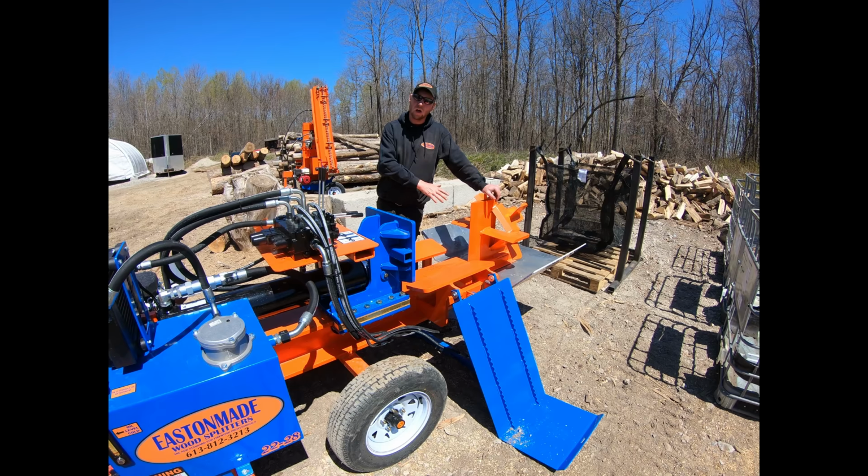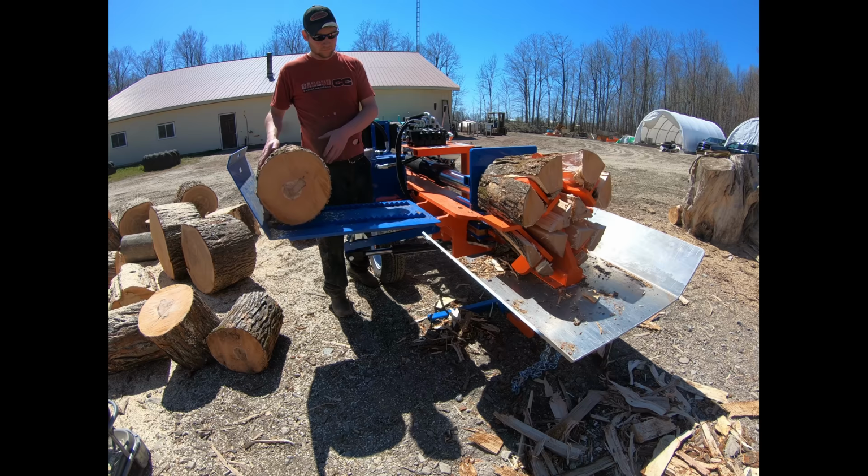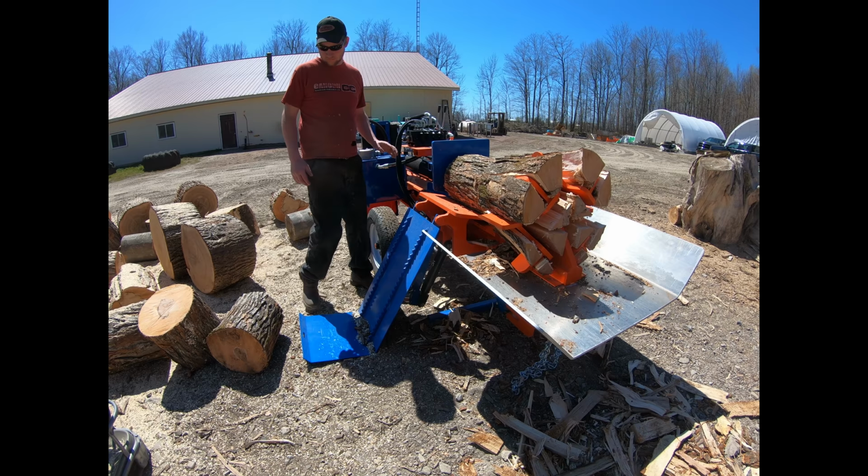They have their place, but they're not an end-all solution. Normally when you're purchasing a machine like this, you need a couple of different wedges to maximize your efficiency. These 12-way wedges are really good up to around 18 or 20 inches because you're one pass all the way through and you have nice looking firewood. Because of the way this is designed, you get four pieces out of the middle, and then eight around the outside.